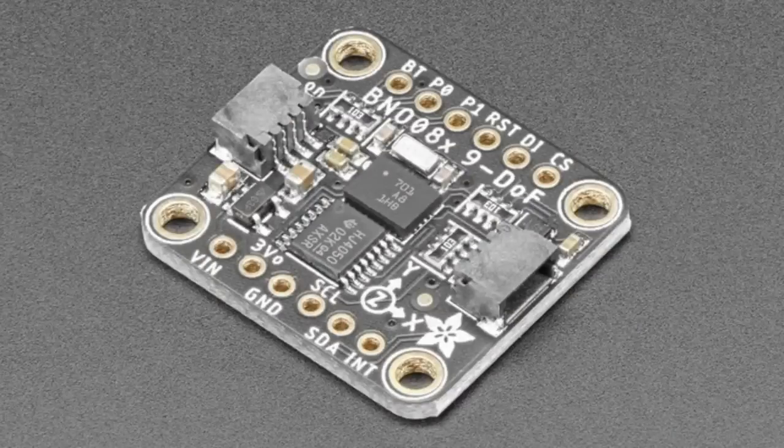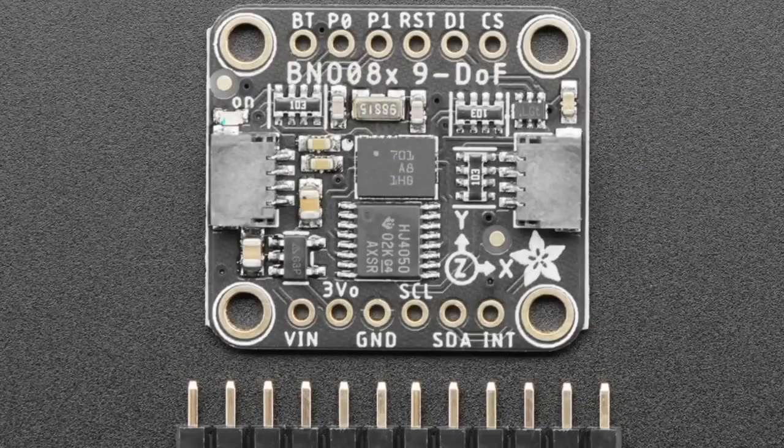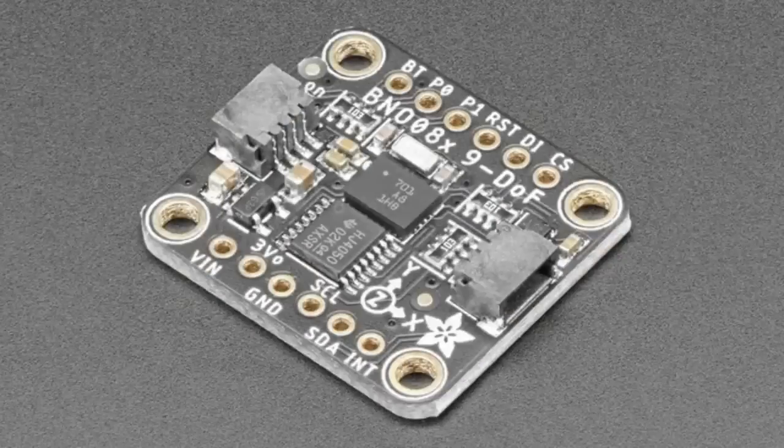So what is this? This is an all-in-one inertial measurement unit. If you've got an accelerometer, a magnetometer, and a gyroscope, you know they can measure twist, motion, and the Earth's magnetic field. You can combine those using algorithms to give you true orientation in 3D space — so you know which way you're facing, like north or up. Your phone does this when it tells you which way to go for directions. It can also tell you tilt, axis, and attitude.